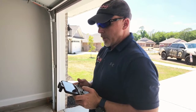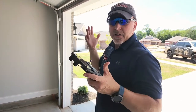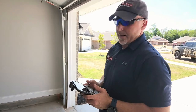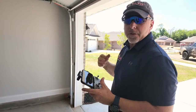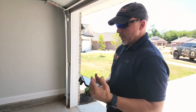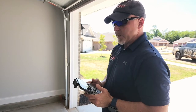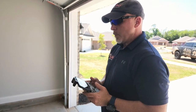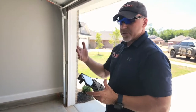You're checking the sealant around all of the exposed nails, because realistically water is going to get into your house at any point that it can, and once water gets in, it does the same thing it does out on the dirt — it starts making a bigger hole. You check the sealant around any of the fasteners or nails, all the main joints, where you see a higher volume of water. You check there for all of the flashing and all the sealants.